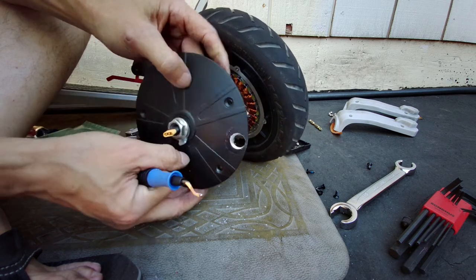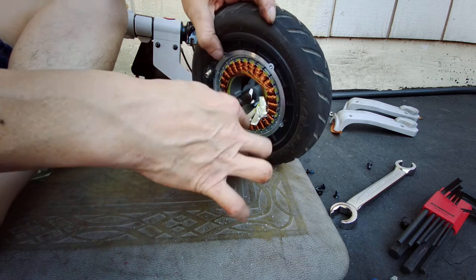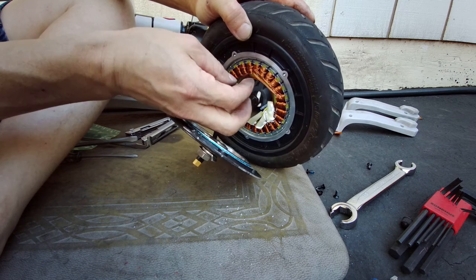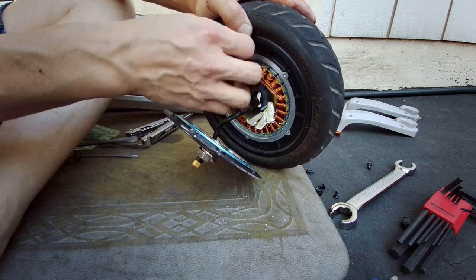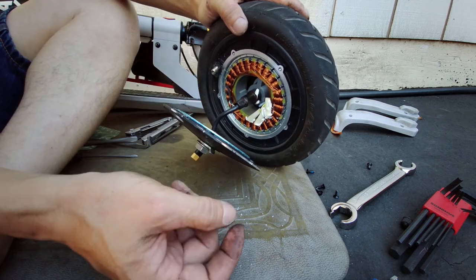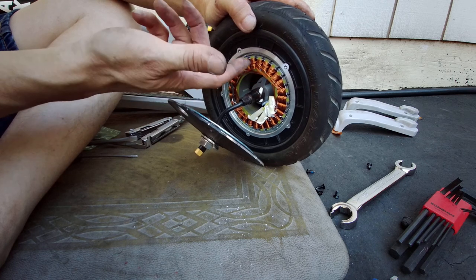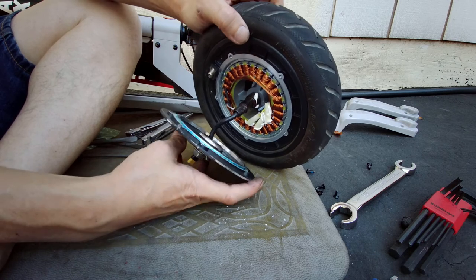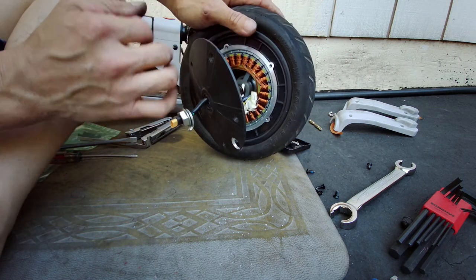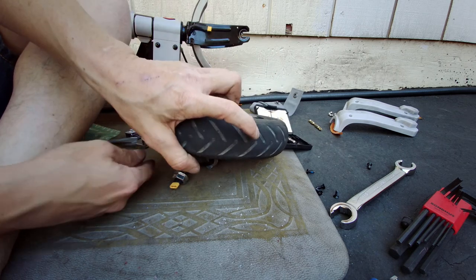It's a little bit uneven right here — a little bit more on this side and a little bit less on this side, so I have to adjust accordingly. Anyway, that's how you do it. I'm going to do the rest of this off camera, and I need to cover this up. You should use an air compressor and blow it out inside here first so whatever dust or debris is on the stator or on the coils will blow out. Blow it out really well so everything's clean and particle-free, because even though aluminum doesn't attach to the magnets, aluminum particles could land somewhere else and since it's conductive it can cause a short, and you'd burn out your motor. So I'll show you guys the results once I have that done. Thanks for watching.